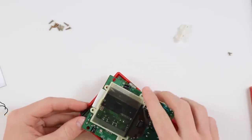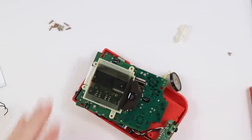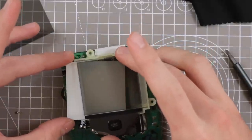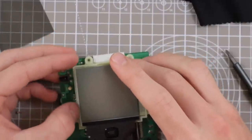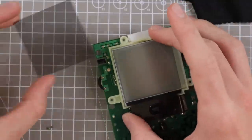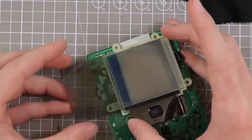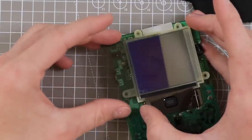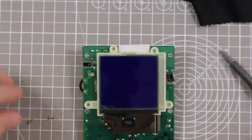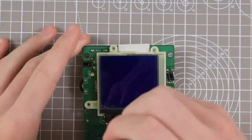We need to install the bivert chip and the backlight. I want to do the backlight first because it's a little bit easier. I'm going to zoom the camera down and get my soldering mat, turn the soldering iron on. I found a polarizer film — when you install these you want to make sure you're getting it in the right orientation. You can just slide the backlight in there pretty easily. To get the polarizer film in, a lot of people cut down the little white shield underneath, but I'm not going to do that here. You can see the two orientations — it's also a different orientation if you rotate it the other way, so it's not quite as dark. Put it in like this, make sure everything is slotted in nicely. You can pick up all of these parts on eBay — I'll leave links in the description. Then grab the two little screws from the ribbon cable and pop them back in.